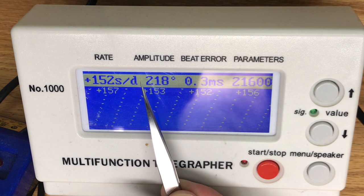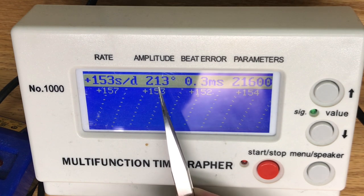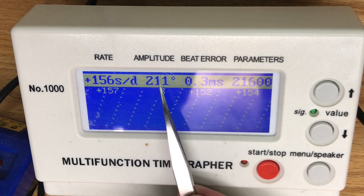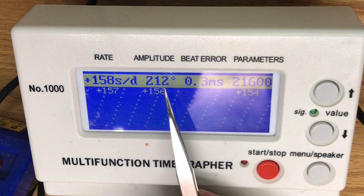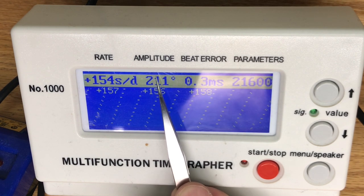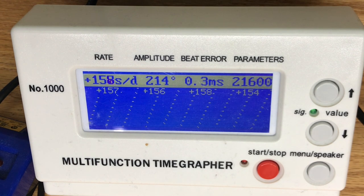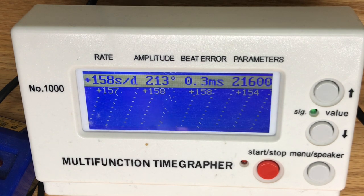For a great watch, this number is 240; for a decent watch, it's 225 to 230, and that depends a lot on the condition of the materials inside the watch. If you've got wear and things, it's going to be in the high two-twenties, low two-thirties. But if it's a great watch, it'll be way up into the two-forties. Generally, this watch is on the cusp of needing something. If that means you want to take it to the next level, of course we can do that — a service can get this number to where you want it, meaning less friction and less wear within the movement.